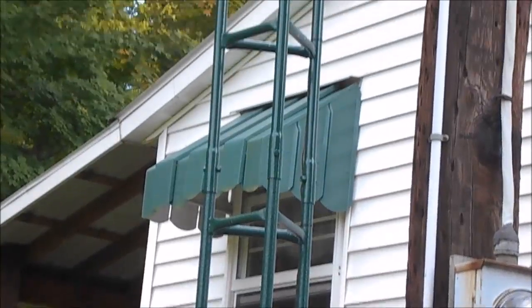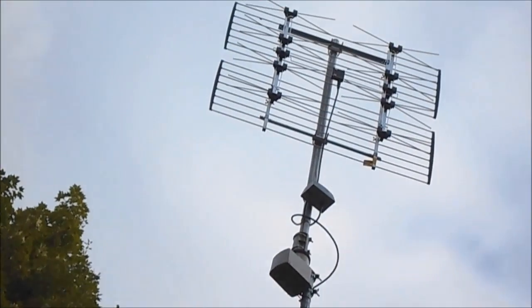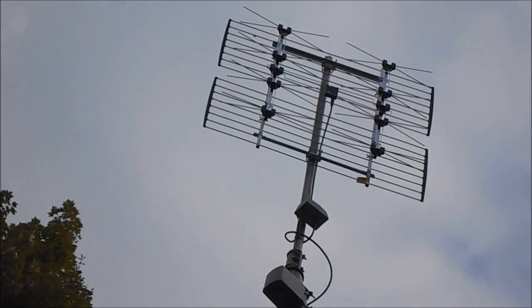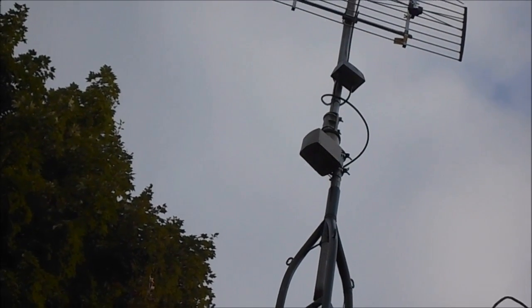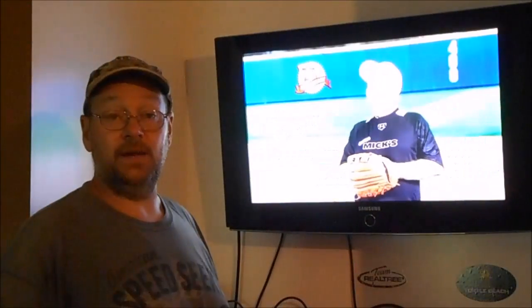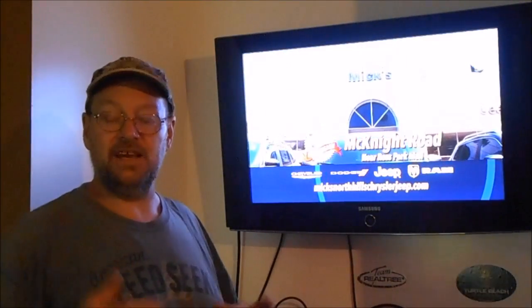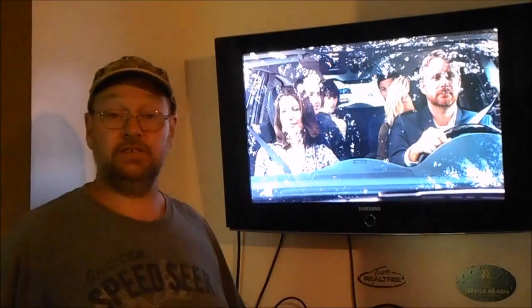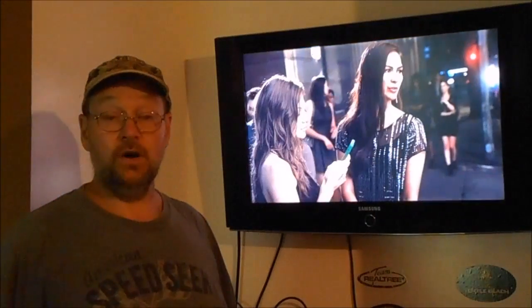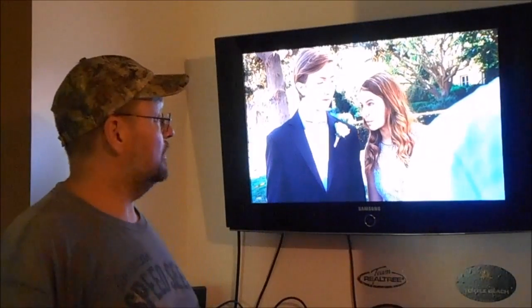It's 20 foot high and I do have a booster on this antenna. There's the 8-bay antenna — best antenna I ever had. I do have a rotor on there; we'll talk about that rotor later. There's a booster up there right above the rotor. When I bought this Channel Master booster, they had a high output and a low output. I called Channel Master when I was buying the antenna, they switched me over to a technician, asked me what area I was from, and told me what booster I needed. Depending on what area you live in, that's going to determine what booster you need for your TV.